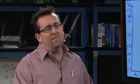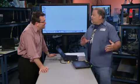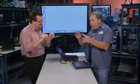Why is this such an important topic right now? Power over Ethernet, and specifically enhanced Power over Ethernet, which is in committee right now — let's go to the Wayback Machine and look at AF. 802.3af is obviously the power standard that we're under right now, approved by the IEEE. It's been there for a while, and it's 15.4 watts total.